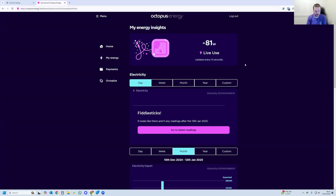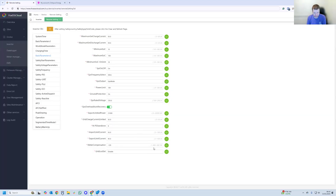It's only a small change in terms of overall ROI, but instead of drawing a small amount I can now push back a small amount. The setting goes from pushing back 500 watts to pulling 500 watts, adjustable in single-watt increments. I've found that about 120 watts is enough of a buffer so that as devices come on and off, I'm not dipping into the grid while waiting for the inverter to respond. This is different to feed-in options where you're actively trying to export power.